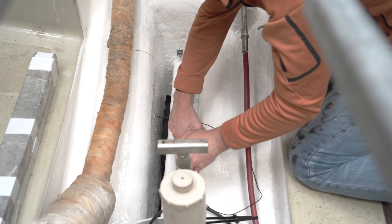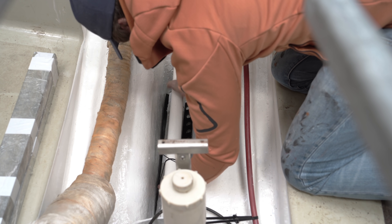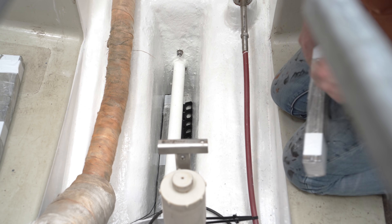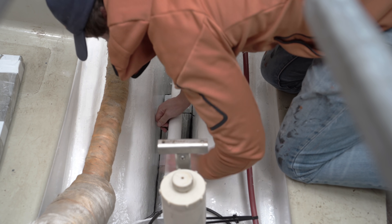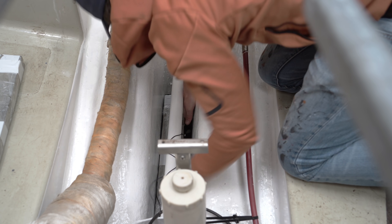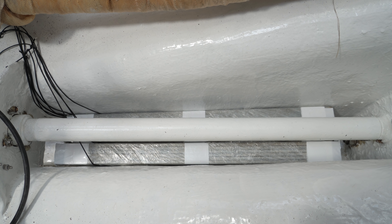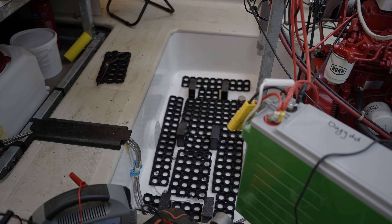I'll start with the smallest zones, around the prop shaft housing. I'm going to be reinforcing this area externally, and this will involve structural through-bolting, so my solution here will be secure but not permanent. Thinking about those ribbons in electronic gadgets that sit behind little batteries so you can flick them out again once exhausted, I'm running very thin loops of Dyneema cord around the bundles. This means the roughly 10kg pieces can be slotted in very tightly but can still be extricated when needed later down the line. We've managed to get roughly the weight of an amply sized person in quite a small space — every little helps.